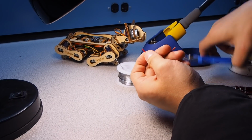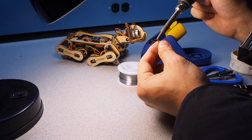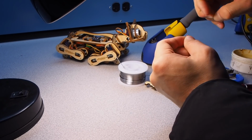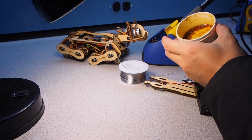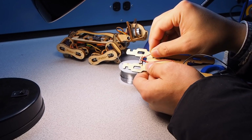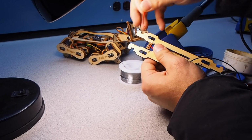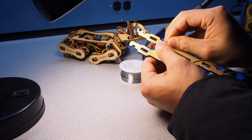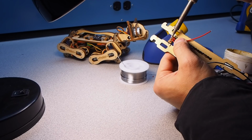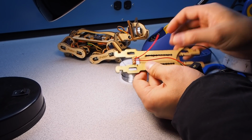And we have this residue wire. Just get this wire exposed a little bit. Dip it in the soldering paste. Insert it to the other hole on this switch. Pay attention, both of the 2 red wires should go in this direction, not this direction, okay? And solder it. Make sure that they are fixed. Then we are ready to go to the next step.